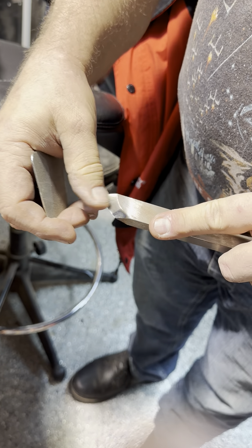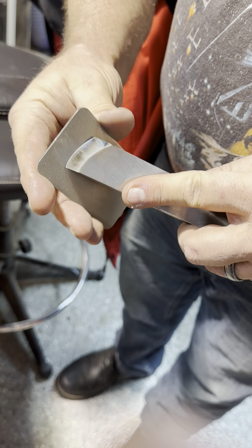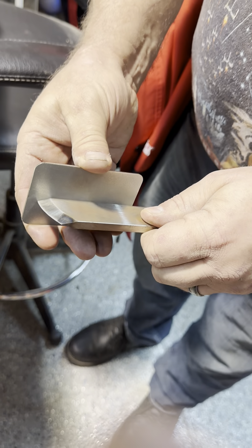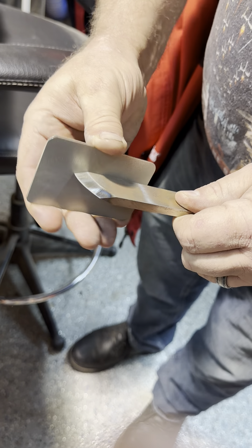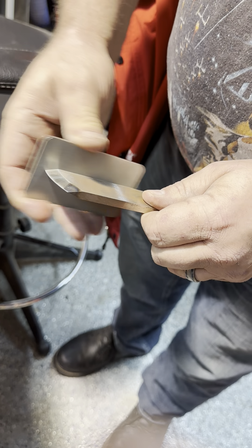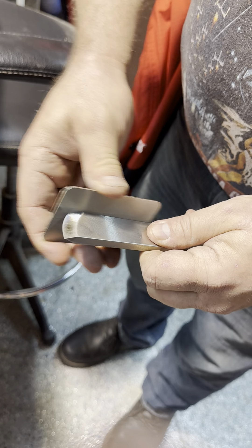Make sure I don't feel a little bit of a burr, so I'm just very lightly going to touch that one edge and get rid of it. Then finally I'm going to hold it flat against this side, because that point is a cutting edge and I need to hone that, then flip it over and do the other flat.